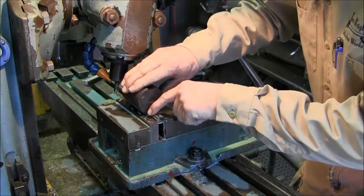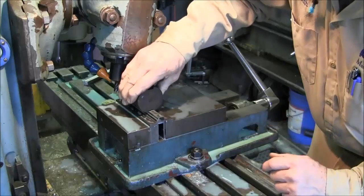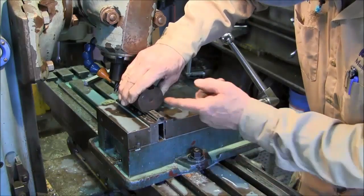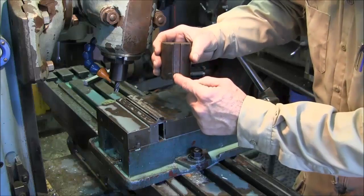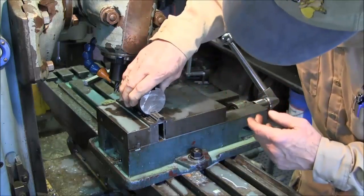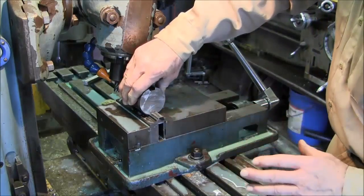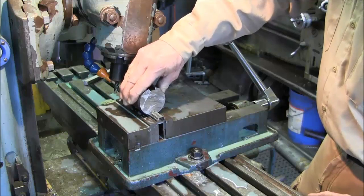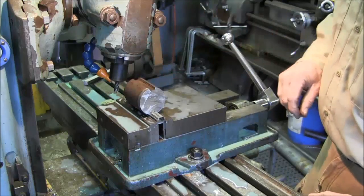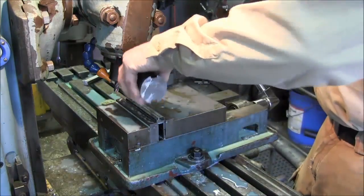We're going to take it out. We're going to roll these sharp edges over, because it's darn close to bottoming out right there, and I think that's a sharp edge, and there's a slight radius down in here. Turn around and look at it, you can see that it's almost a perfect fit. I'm glad we stayed back. I stayed back about 3 thousandths aside from what I set it up with the dimensions. We're doing great. We're going to throw in the next one.